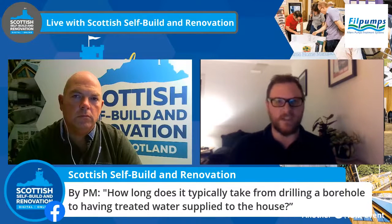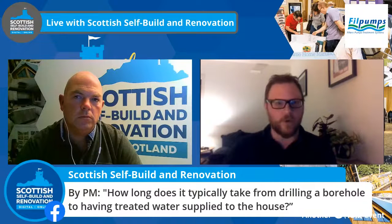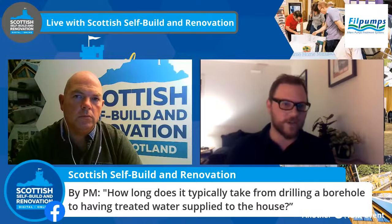Now, especially if it's a new build, we might drill a borehole while the site is still an empty field or just a vacant plot of land. As long as no one does anything malicious to the borehole, that borehole will quite happily sit capped off for as long as it takes. So we could do the borehole for you in the spring and come back spring the following year to install the treatment system. And because of the consistency of the borehole quality, it doesn't matter that we had the water tested last year, it's not going to have changed.